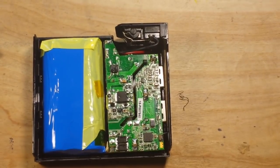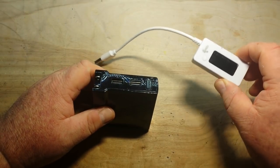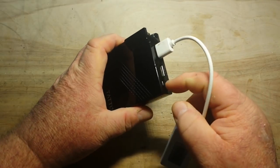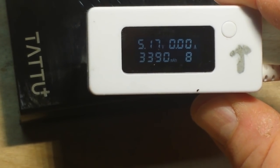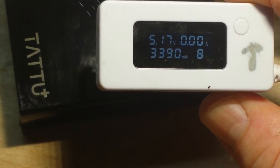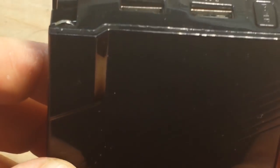I completely discharged the device last night and recharged it overnight. This has a memory for either input or output, so we plug her in and turn it on. We're seeing 3390 milliamp hours, listed as 5000 milliamp hours. Keep in mind that 5000 milliamps is at the nominal voltage of those batteries, so that's about 70% — and 3390 mAh is definitely right on track. This power bank from Gen's Ace and Tattu is probably the nicest one I've ever played with.